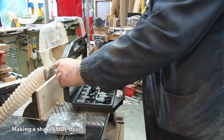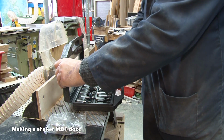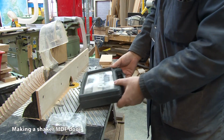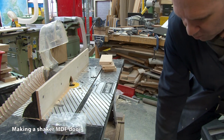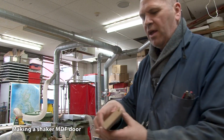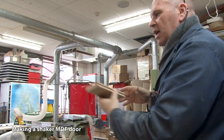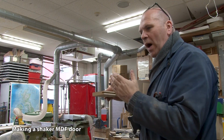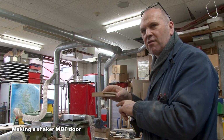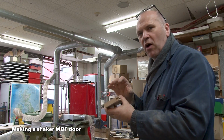But they have machines that are bigger and more advanced, and they are called 5 cutters. Because instead of having just a single cutter like that, which starts to blunt quite quickly the more you do with it, they have machines that are set up where they'll have 5 cutters spread across a diagonal line almost, and as the material feeds in, one cutter will start cutting one bit, another cutter will cut another bit, another cutter will cut another bit, or it might be a 3 cutter. It depends on how much needs to be involved in the moulding.